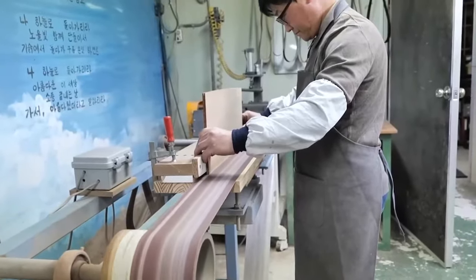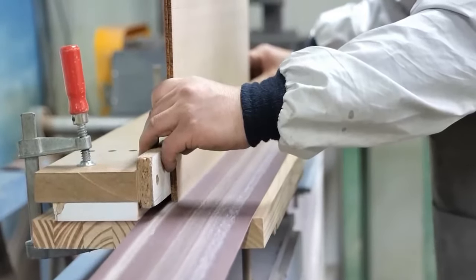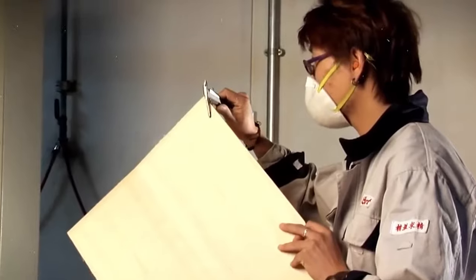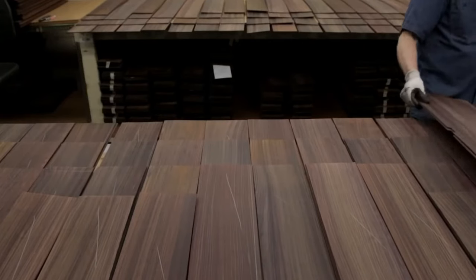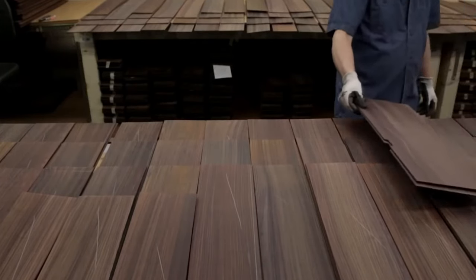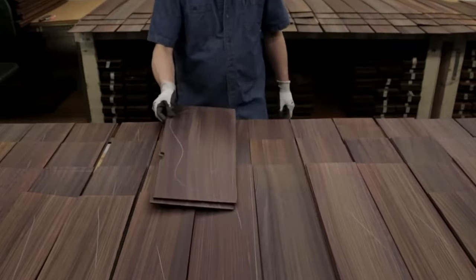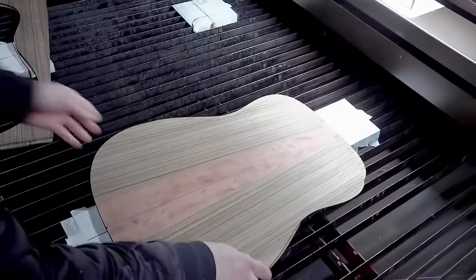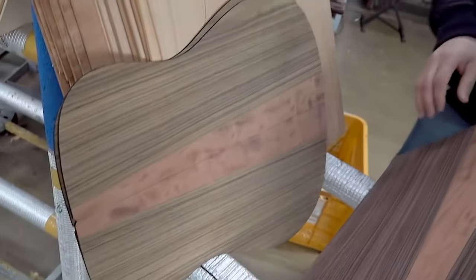After close observation, the two sheets are glued together and left to dry. Once the glue dries, the new board created by joining the two sheets is sanded until the desired thickness is achieved. It is again inspected for quality, and when done, is graded according to color, regularity of grain, and closeness, and ensured that it does not have blemishes. The next step is to cut and shape the top into the guitar shape, though the piece of wood is left oversized since there'll be a final trimming process involved.